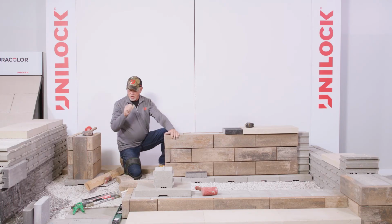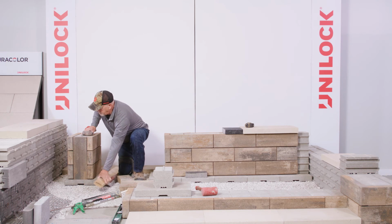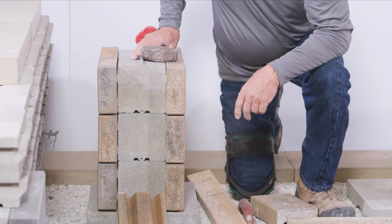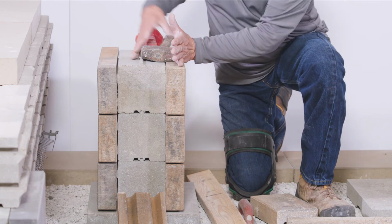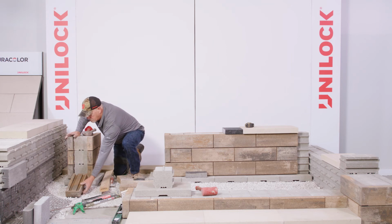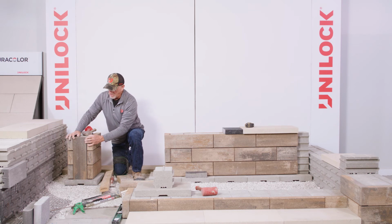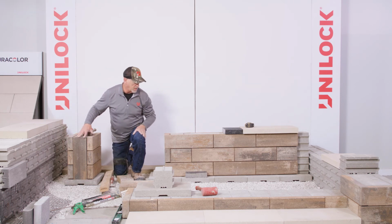All right, a third option for you on ending a seat wall would be over here in this area. I'll drop that panel down and expose what we've done here: end fascia panels with lefts and the fascia panels here with the rights. We cut this 18-inch increment, taking a panel that is 18.5 inches long and cutting it to that overall height. So that's a simple and easy method as well. A few options for you with that.